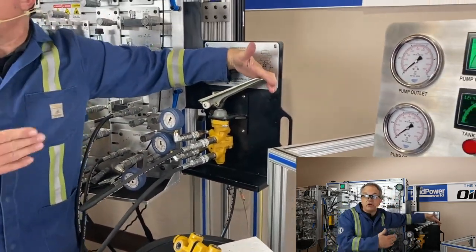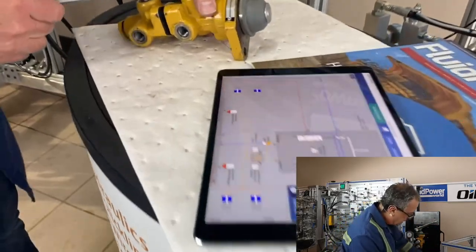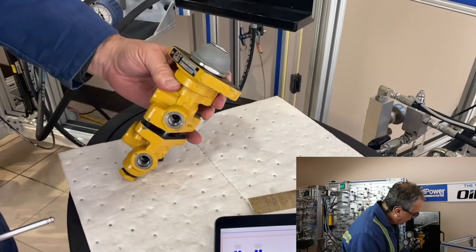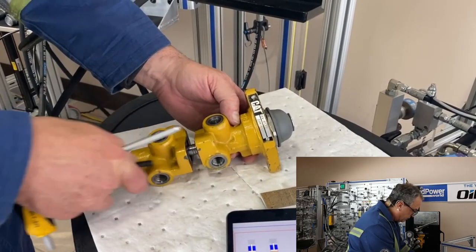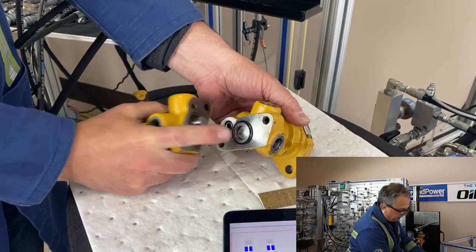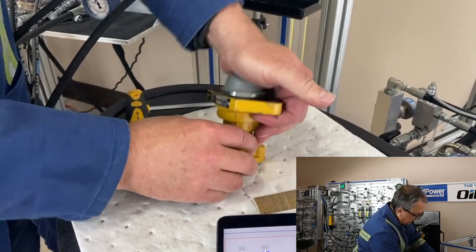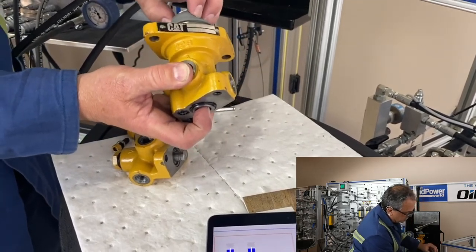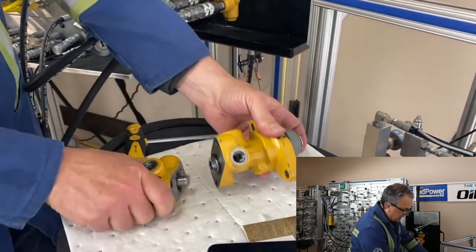So really, this too is just another one of the many variations on pressure-reducing valves. Let's work on one I've got right here on the bench. It's exactly the same model, and it's basically two separate valves in one. I'll just take it apart and we'll have a look at one of the two. They work together in tandem — one spool from the upper half is pushing on the spool in the bottom half. When you're pushing on the top half, you're not actually moving the spool. You're tensioning a spring. That's all that's happening up here under the rubber cap — springs are being compressed.